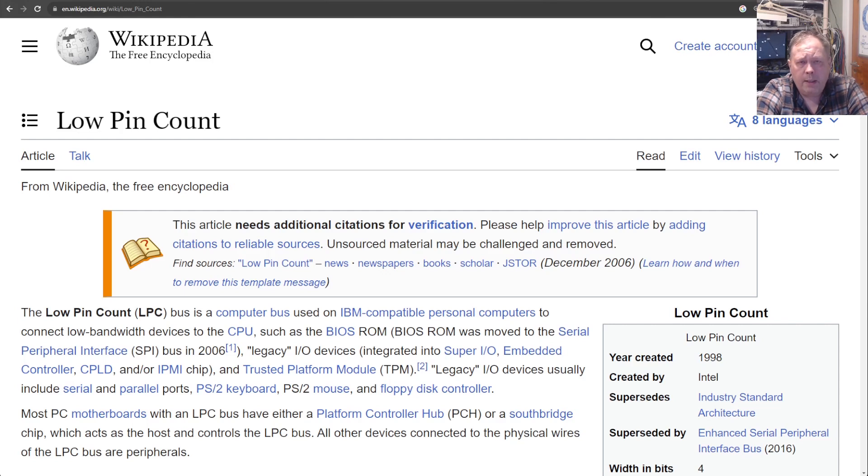This is really old technology — we're talking Pentium 2 era. This was a time when Intel was trying to get rid of the ISA bus, which is expensive to implement because it has many signal lines and only communicated at 8 MHz. The LPC bus was made as an alternative to connect devices on the motherboard that needed ISA functionality — things like serial ports, parallel ports, floppy controller, sound cards, and other ISA peripherals.